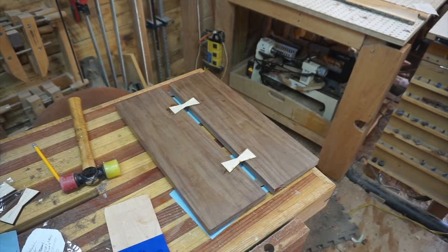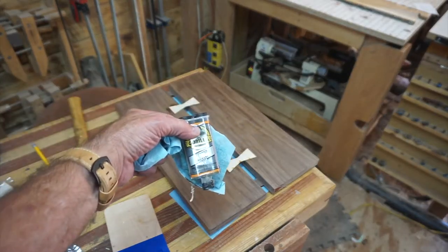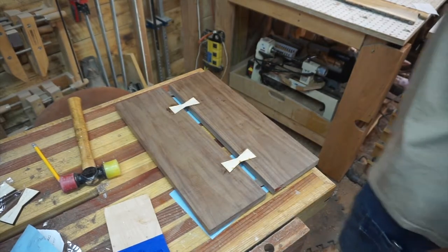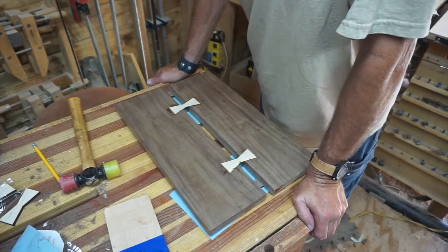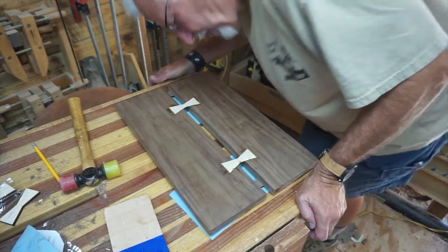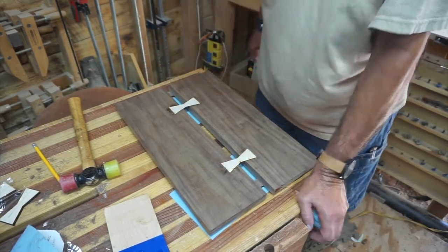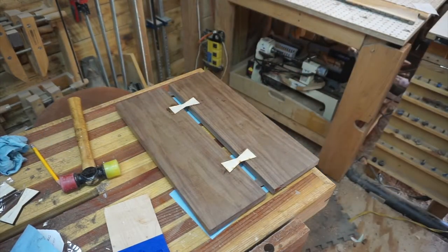All right, I epoxied these in with Gorilla Glue 15-minute epoxy. I don't know if that's focusing or not, but anyway, Gorilla Glue epoxy. Pounded them in. They were pretty tight. It seems like these newer ones I got were a little bigger than the original ones I had, and I measured them, and they were, but they still worked all right. They went down all the way, just barely protruding there, just enough to sand off, so we'll see how it goes after we sand it, see how it looks, see if I made a mistake using those tiger maple ones, but I don't think so. I think the contrast will look good, especially for something else I've got going on here, you'll see later on, this tray.